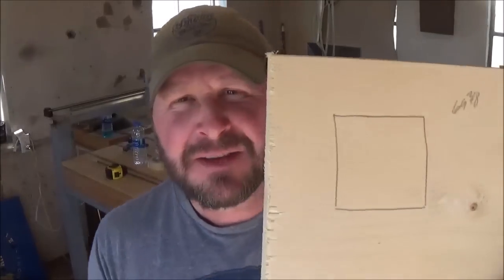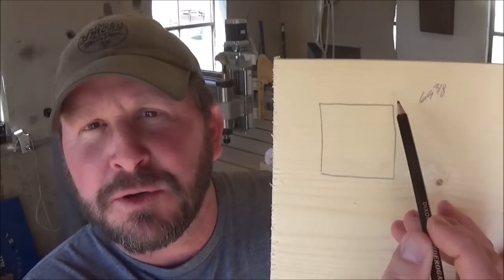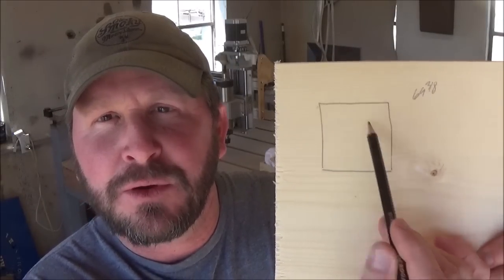Now the next thing, if you've got the frame all together, is you want to make sure it's perfectly square. The easiest way I know to make sure it's perfectly square, if I can get in here and not get washed out by the light, is you measure from a back corner to the opposing front corner, then to the opposing front corner, and you go back and forth.